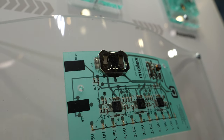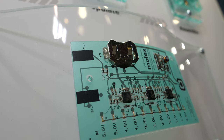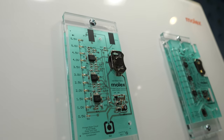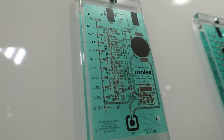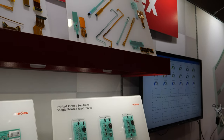This is a silk screen process, and we're able to build the equivalent of a four to six layer PC board on one layer of substrate by adding layers of silver and dielectric and being able to create vias between top layers and bottom layers.